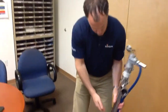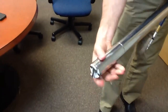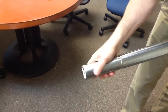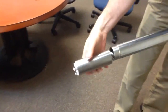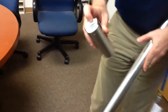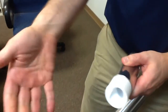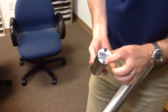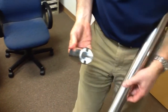The first thing you would do is pull the pump out of the drum. And this is the rotor stator housing. So I'm just going to take this off — it's just a thread. There's the rotor. Here is the stator housing and this is a Teflon stator. You can take this out to just clean it. And when you put it back, there are little notches that the stator just goes into.